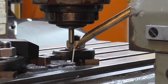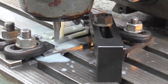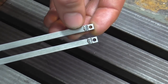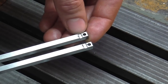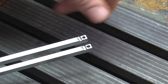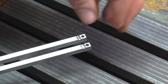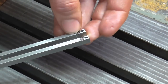Well I couldn't have formed a bigger burr if you'd paid me, but apart from that that's come out fine. The cutouts are milled in and you can see what I mean about the burrs. A couple of factors may have added to the burrs: one is spindle speed — by modern machine standards 1200 rpm is really quite low for a cutter of that diameter. Also the material — this is tool steel. Were this free-cutting mild steel I would have expected a much lesser burr, but any deficiencies in the cutter, particularly on tool steel, does tend to throw up quite a stiff burr.